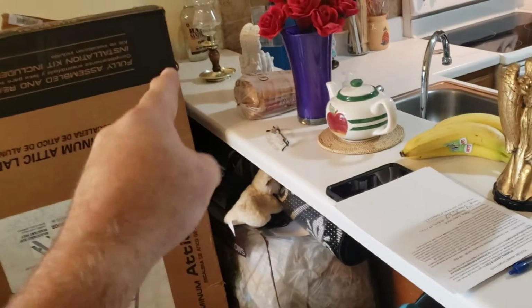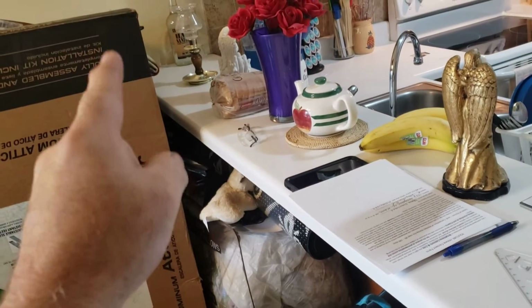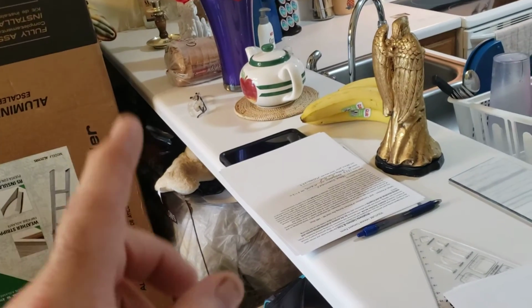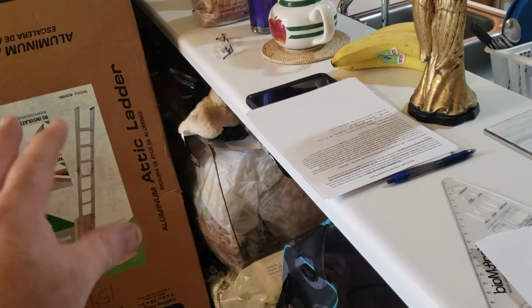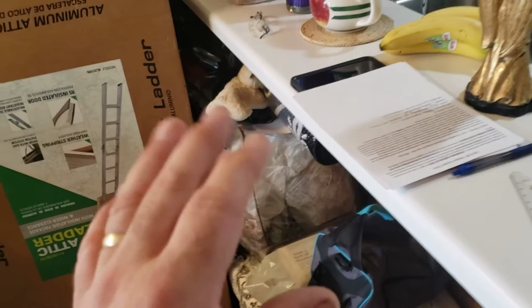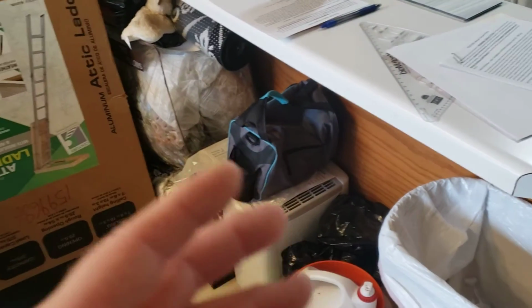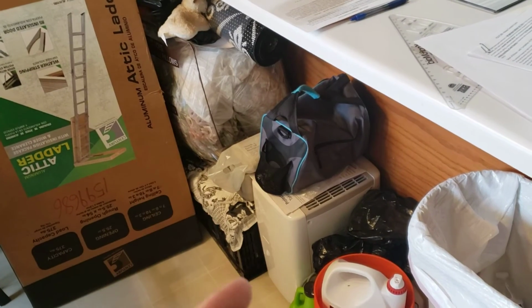Again, the cabinet on the left-hand side of this must be at least an inch, maybe 1.5 inches off of the left-hand wall so that your hardware and everything doesn't smack the wall and doesn't make it unusable as far as that corner. She wants to use all this space on these taller cabinets in the back for appliance storage and stuff like that.